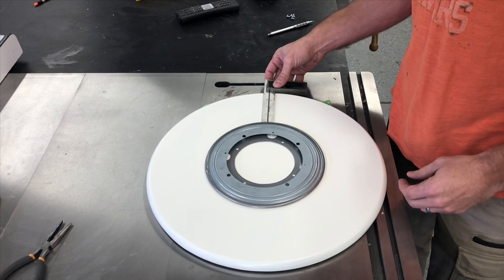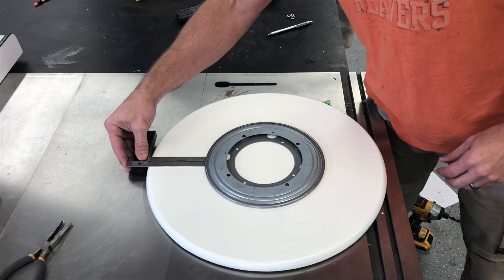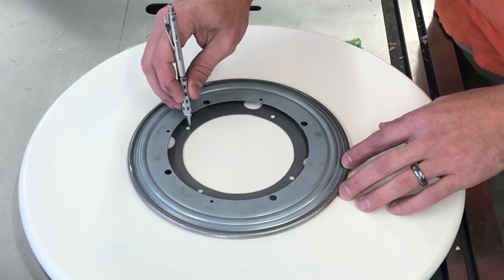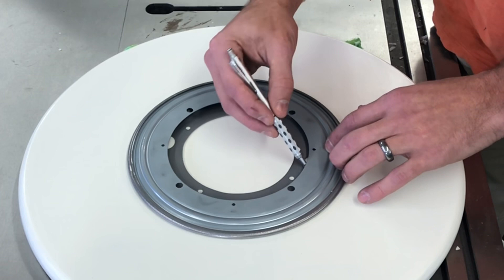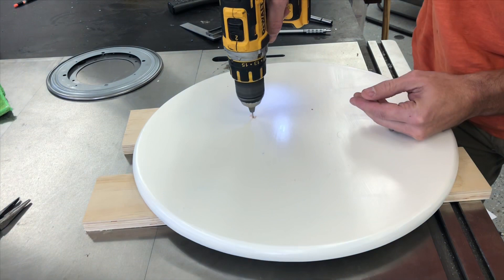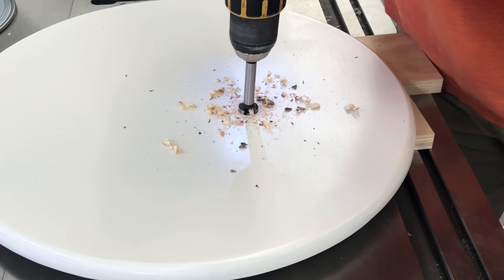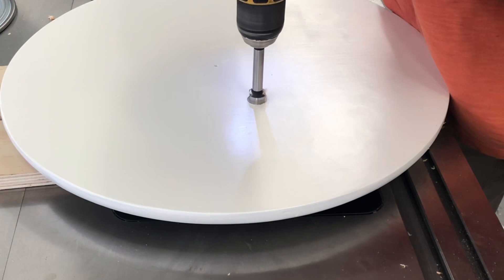For the revolving mechanism, I went to Woodcraft — they have a surprising amount of Lazy Susans. This one was like six or eight bucks, shockingly cheap for a cool little mechanism. This is the very bottom plate and I'm marking my holes to drill. I'm marking the mounting holes plus one visual hole — that visual hole is how you attach it to the whole shoe rack itself. The larger hole I'm drilling lets you peep through to mount it to the main shoe rack piece.